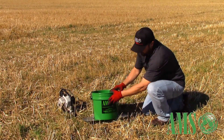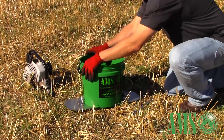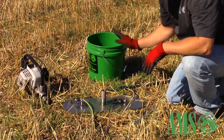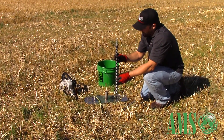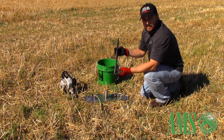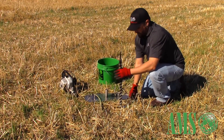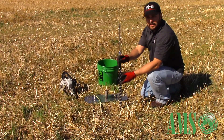Included with the kit is this stainless steel foot plate. You basically have a 3.5 gallon bucket with a hole in the bottom of it, and your stainless steel foot plate. You've got an inch and a sixteenth by 18 inch of usable flighting on this auger bit, which has a carbide insert in the tip. This will get you down to 12 inches. To get from your 12 to 24 inch interval, there's a 12 inch extension that quick connects onto the auger.